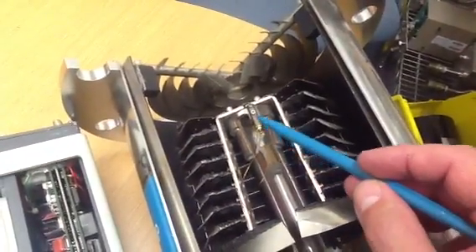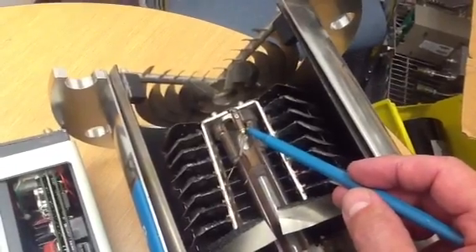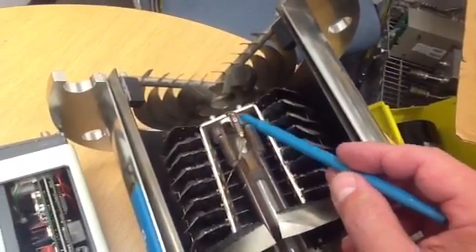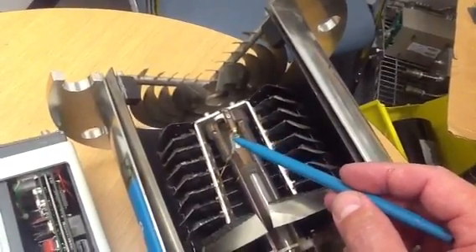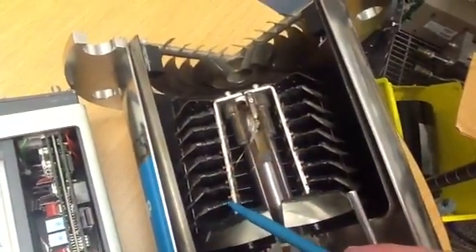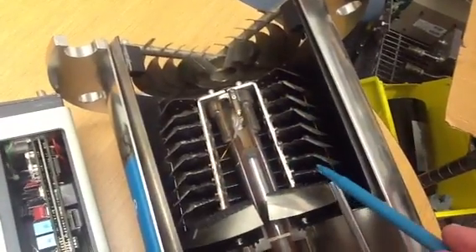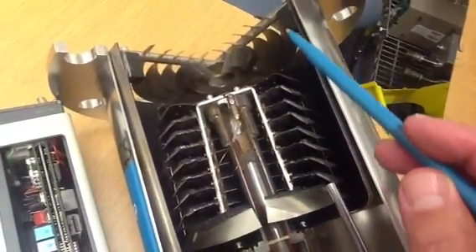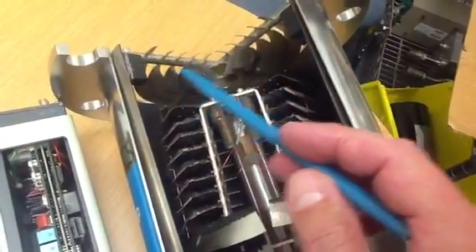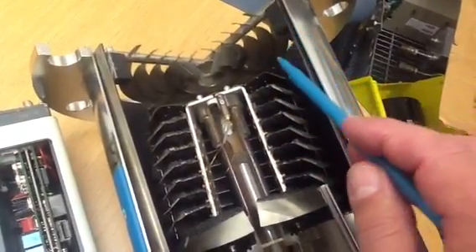I'm just going to show you this one because it's a little cleaner. That sensor, which is a Lakeshore diode — we're going to get that curve and take a look at that — is actually measuring this top section of that system. You can see this is all the charcoal attached to all these arrays, and this basically gets filled with gas. Water vapor gets trapped and comes through these louvers, getting trapped along this outside edge.